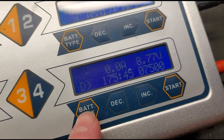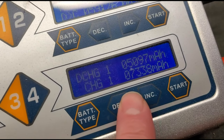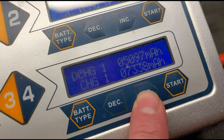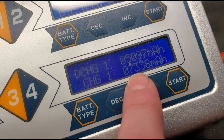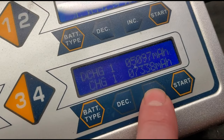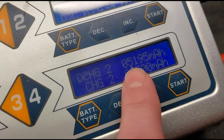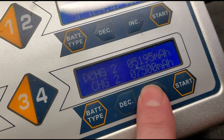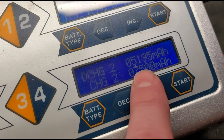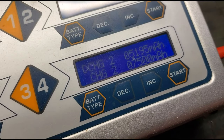The battery that had a capacity last time also has a capacity this time. We've got 5,097 and 7,338. That was the cycle that did capacity, and we've gotten to over 5,000 which is what we want. Let's make sure the next cycle looks good — 5,195 and 7,500. So this battery is done and it's good because it has 5,195, which is more than 5,000. We're going to label this one as good and move on to a new cell.